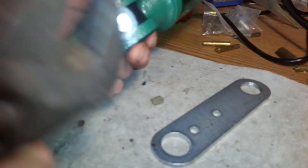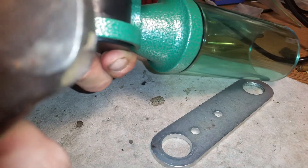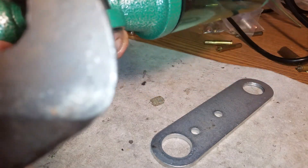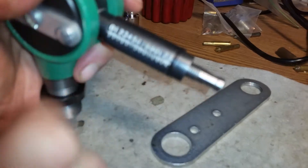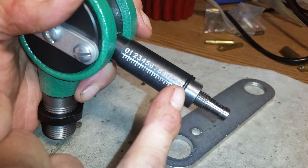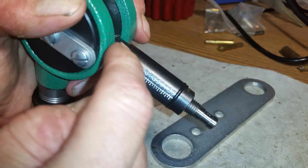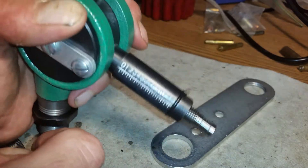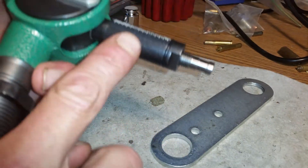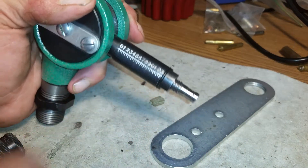There are flats on the end here, so I'm going to tighten that up — just snug it in there, reasonably snug. Those shims set the index on this so it's in a position where you can look at it. If you take some of those shims out, this index line will be a little higher because you're threading in a little further. So depending on whether you're looking down at your feeder or need to look up, there's the index line.